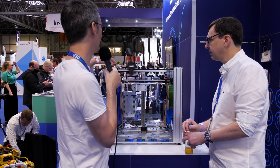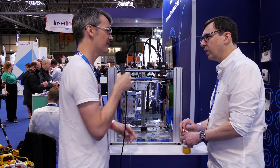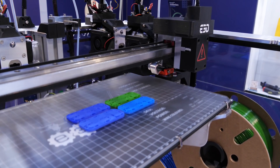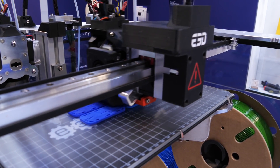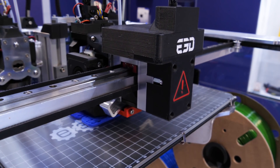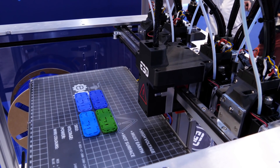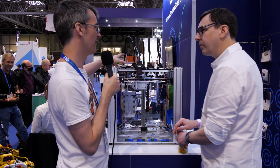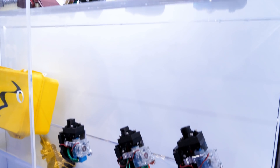The last time I looked at this was 2018. Back then there was a servo that did the tool change, and now this looks like a bigger, more substantial, well-developed unit. Yes, we have a small micro stepper inside which manages all of the tool changing and tool pickup. It's rated to around a million to a million and a half tool changes before it fails — which sounds like a lot, but if you think about it, each print averages four to six thousand tool changes if you're using all four tools at once, so we need a good quality motor in there.